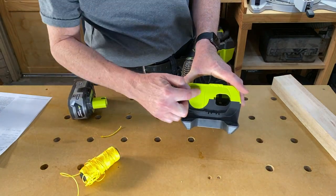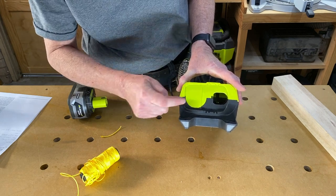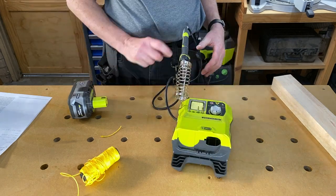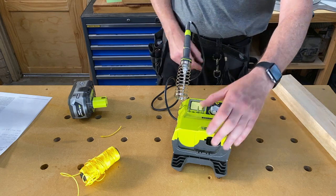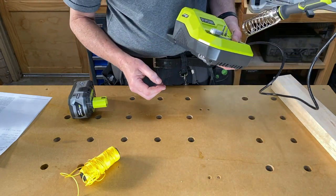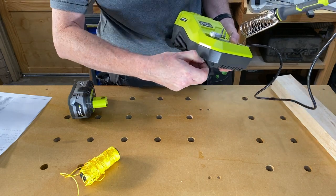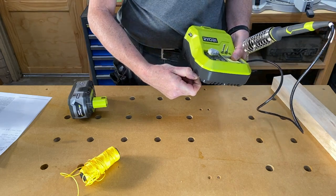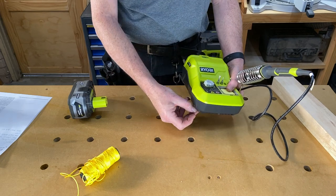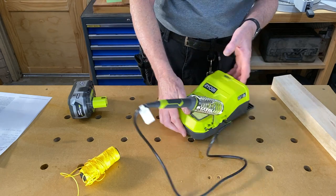It's not hybrid. But if you have a look at this — maybe they were thinking of making it a hybrid unit, because that looks to me like it was going to take a mains plug and they changed their mind. Would that be great if it was a hybrid unit? Also on here — to some of you this might not make much sense, but those of you who do a lot of soldering will appreciate this — there's an earthing hook. So you can clip this with your anti-static strap and hook it to the same anti-static mat, so everything will be at the same potential. Great way of stopping you zapping things.